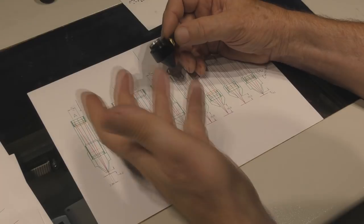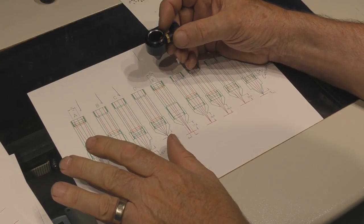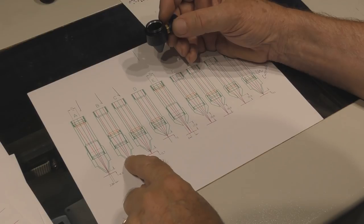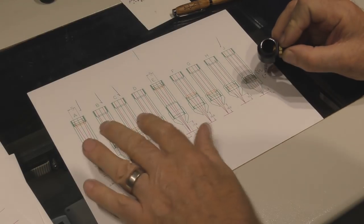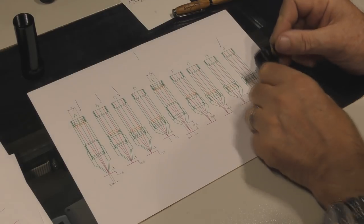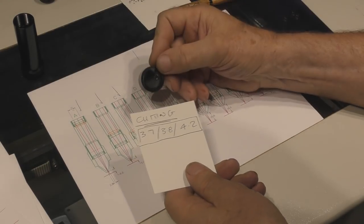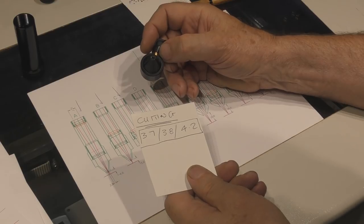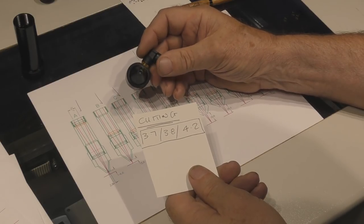We could call this a universal nozzle — with a small groove in the back, which I'm trying to persuade a manufacturer to add, we should be able to cut with a 4", 2.5", 2", and 1.5" lens. The 1.5" lens needs to be 18 millimeters rather than the standard 20 millimeter — a very small compromise. The only problem now is to work out what size hole to make, and I need to do experiments measuring power loss across the nozzle before and after to determine if it's significant.